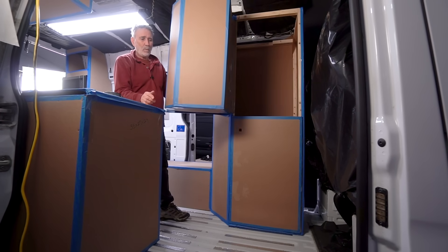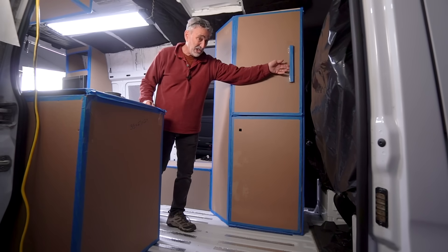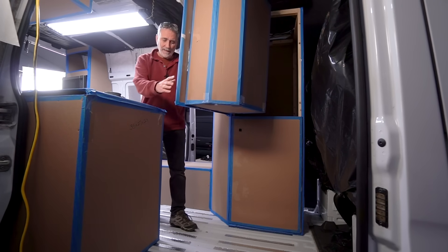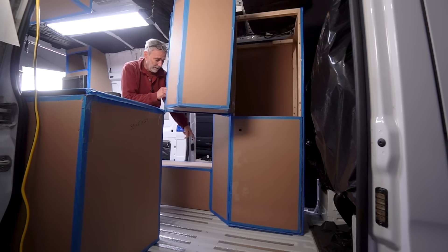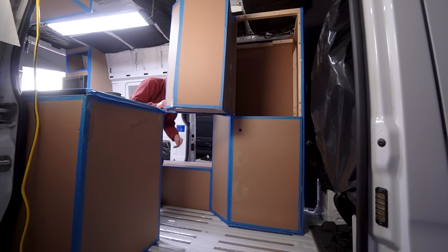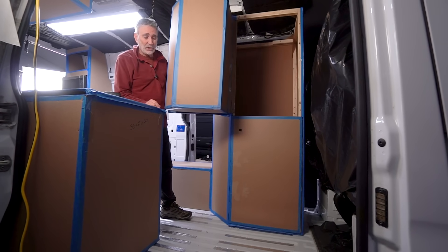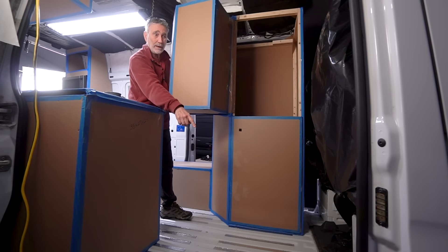The armoire box is on the back of that shower door. We made sure at this size it would only be this tall so it clears the countertop — it just passes over the corner. If I shorten it slightly we can clear this and I could make it deeper, almost full length. But then at that part we'd have to go over the bed — so it could swing over the bed, which I might do. You're going to have a door within the door — that's how you get to your clothing. When you're done with your shower and this is open, this will also be open shelves to your clothing, so you can step out of the shower into this big open area and get dressed.